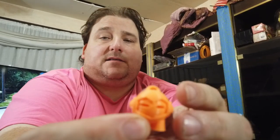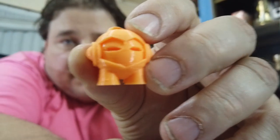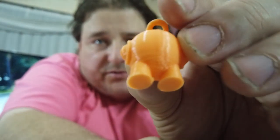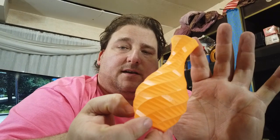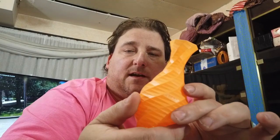First up I printed a Marvin, and it is an excellent Marvin — I have zero complaints. There is the Marvin. Back of the Marvin looks good, no issues. Overhang good, no droopy butt. Good crotch, no issues. Strong keychain — I cannot break that with my finger. That is impressive. And of course I made the rose for your girl vase. Always a nice print. Nice clean lines — the glistening is an indication that the layer alignment is pretty good. And it's watertight — yep, that'll hold water.